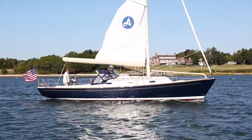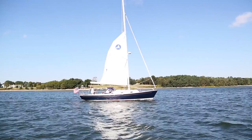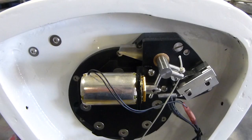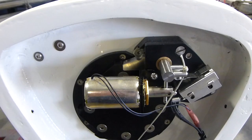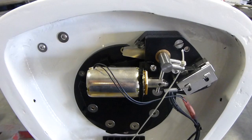The boom angle is not as critical when unfurling the sail, but you want to be close to keep tension on the sail even and make the hoist as easy and low-friction as possible. You will need to follow a few steps in the unfurling process. First, you need to unlock the mandrel — remember the pawl and ratchet at the aft end of the boom. This is done from the control buttons on the switch panel, which allows the mandrel to rotate and unfurl the sail. If the pawl is not released from the ratchet, the mandrel will remain in a locked position, making it impossible to raise the mainsail.